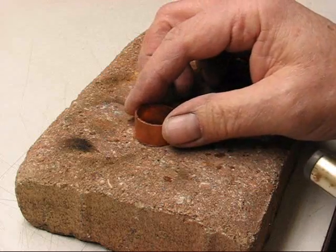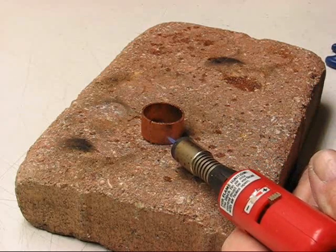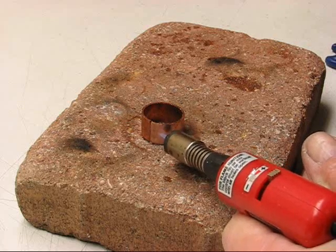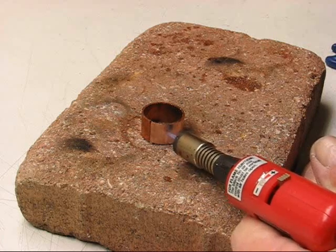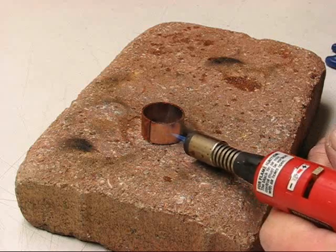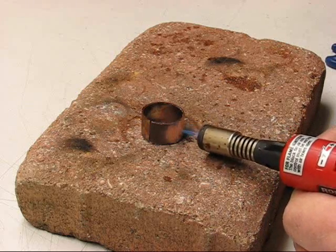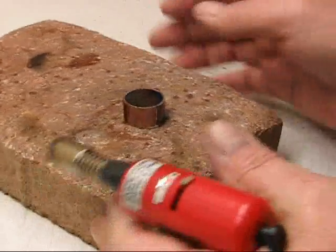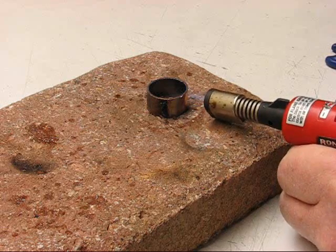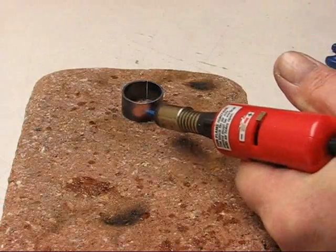I want to show you quickly the way that I make copper soft. That's just to take a torch and heat it up until the point where the copper really changes color and gets almost silvery looking. Heat the copper all the way through and all the way around. After it cools, you see how it turns color and blackens. That's pretty much how you know you've got it hot enough — when it blackens up real good, you've achieved enough temperature to basically anneal that copper. I'm going to do that all the way around the whole piece of copper.